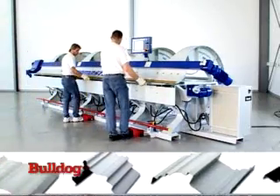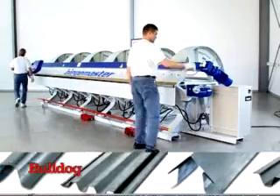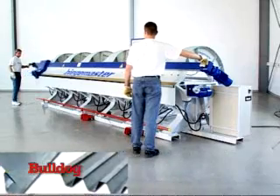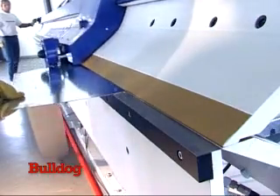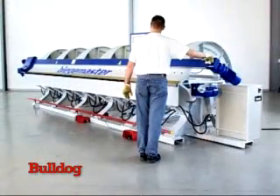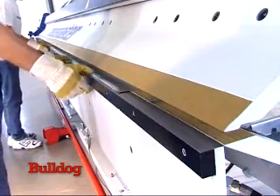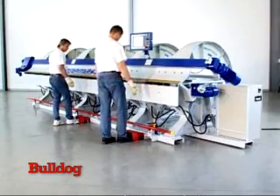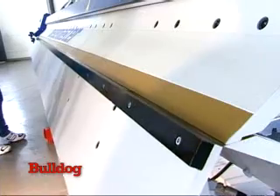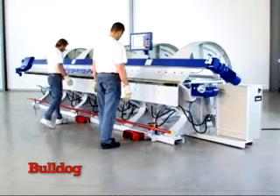The Begamaster Long Folding Machine model BS offers bending capabilities of up to 3mm for steel and 4mm for aluminium. Stands and tension arms are manufactured from the highest quality cast iron, eliminating any risk of material cracks or breaks. As a standard feature, the BS models incorporate a radius adjustment for material thickness setup, as well as a pre-forced clamping beam.